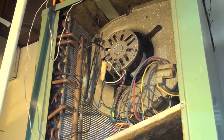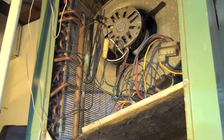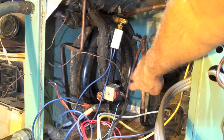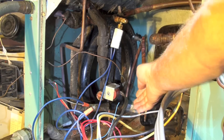Up above here is the air handler. The air handler has a coil that's pretty much similar to any other air conditioning coil, because it is transferring either heat or cooling to air traveling through, and of course there's a fan up there. Down here is our discharge line coming from the compressor.